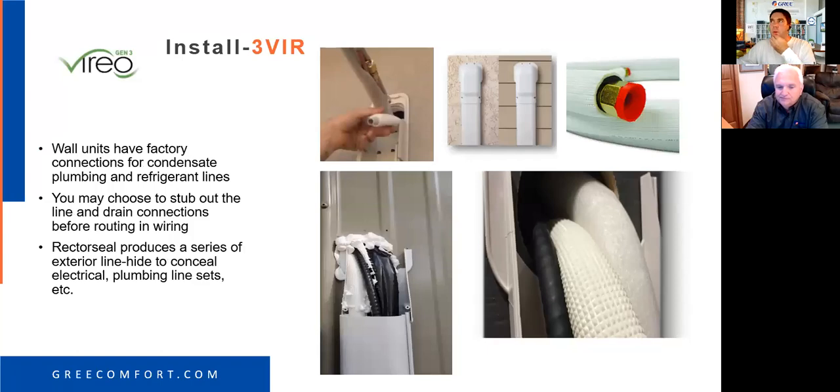And then don't forget, the wall units have factory connections for condensate plumbing and refrigerant lines. When you're making that exit, I've used some of the Rectorseal Line Hide, it makes it look really nice and clean. But something that often gets forgotten, and I get calls about it, is sealing that hole up. So you can see right there, this one that I installed, I used the window and door foam because it's pliable when it dries. I like it. It's easy to clean up once it's dried.